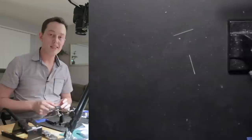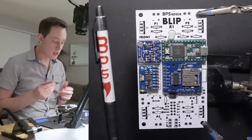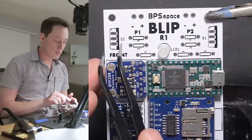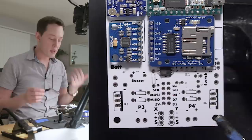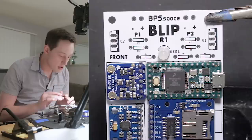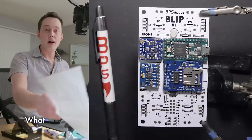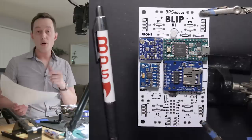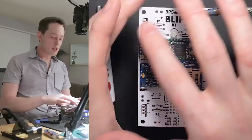For this next part, it's going to become clear why we have this Bill of Materials with us. This is basically a list of all of the components and where exactly they go on the board. There's a little lettering on the board — Q2, Q1, IC1, Q4, C2, R10 — little labels that denote what item in our BOM corresponds to what value. For instance, C1 is a 1 UF capacitor, or R10 is a 1 ohm resistor. So we can go ahead and start placing individual resistors and capacitors on this board based on those designators.